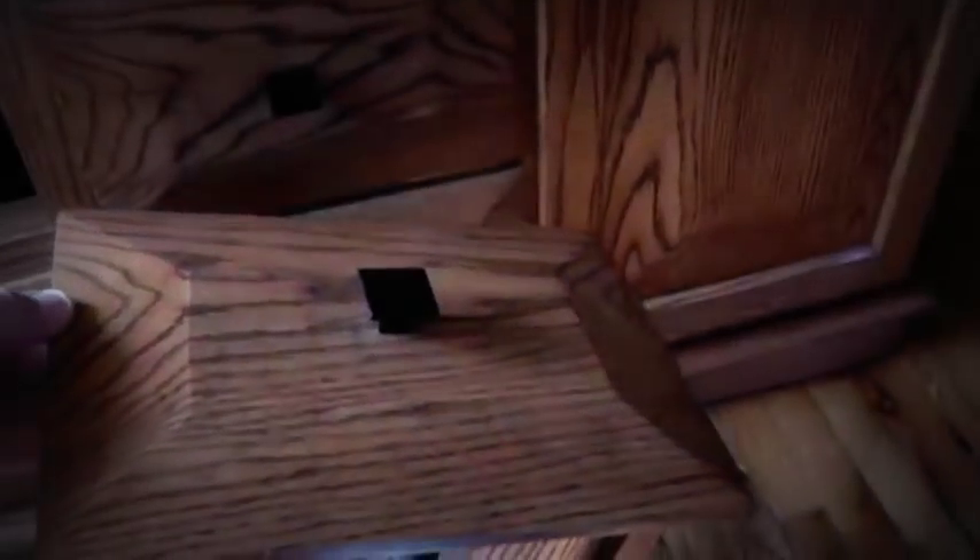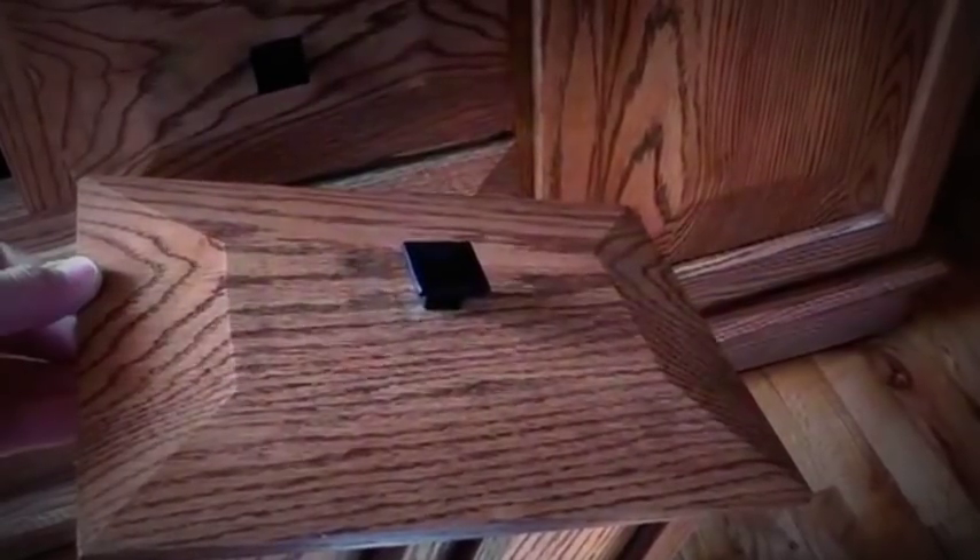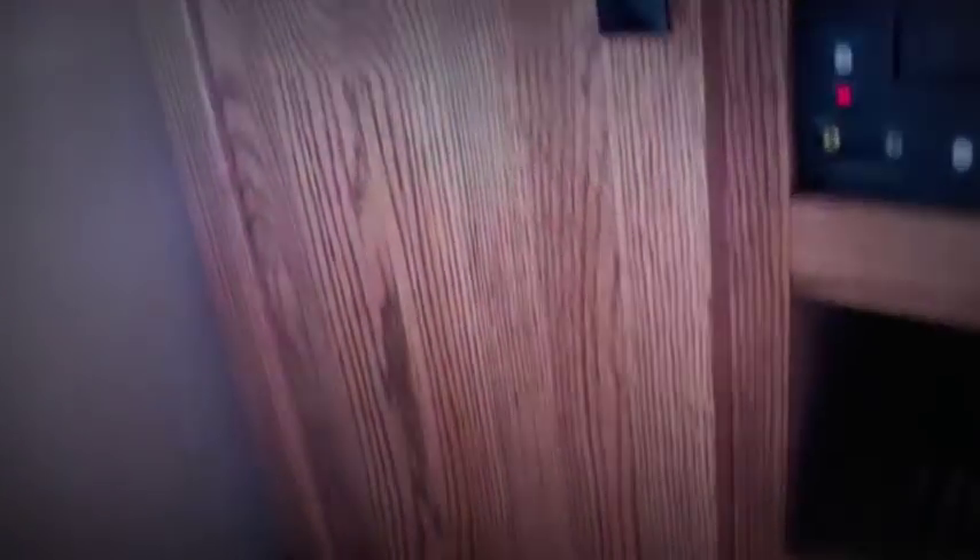I made the drawer guides with the female part here, which you see in the drawer bottom, and the male part in the cabinet. We used a raised panel drawer with some black mission hardware, just made those on the table saw. Brought that same characteristic into the door.